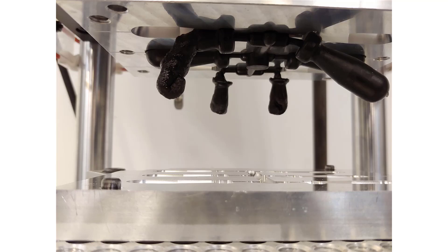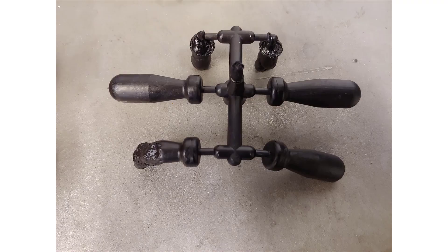In this case we have an underfill, which means that our mold did not fill completely. There are some usable parts but not all parts are usable. This can be due to many factors such as barrel and nozzle temperature, mold temperature, injection time, injection pressure, too little material in the material chute, cycle time, and/or time between injection events.